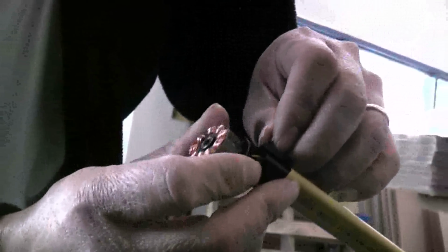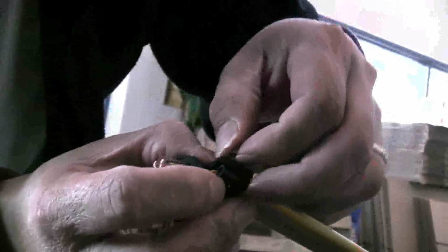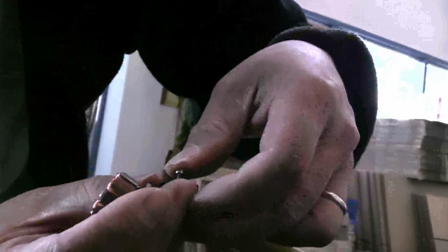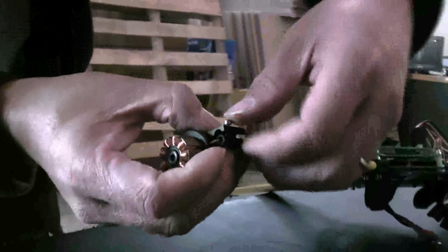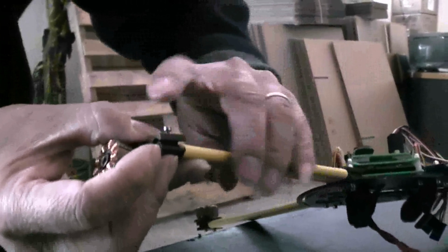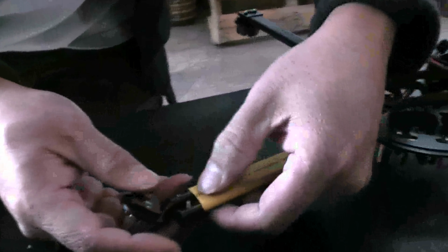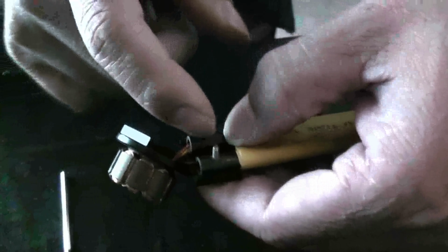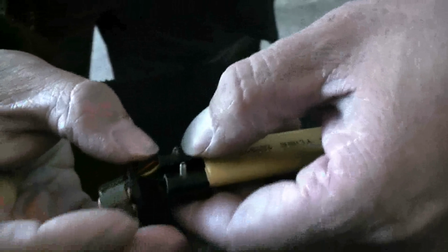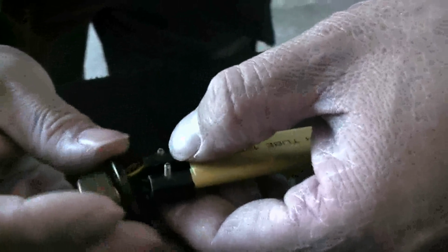And again, when you push the screw set in there, make sure that you're not touching the wires on the screw, so you don't strip the wires accidentally. It's going to be a little tedious, but this is one way to do it, to make sure that you're safe and not destroying the wires. Once you push it in there, at the other end of the screw, you just need to push it over. Once you push it over, make sure that there's nothing coming out, like wires, no red color of the plastic or no black plastic coming out. That means you're clear of those two wires.